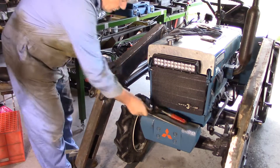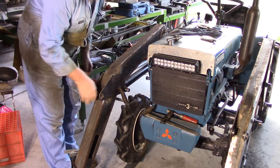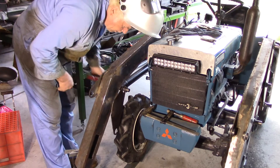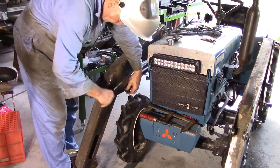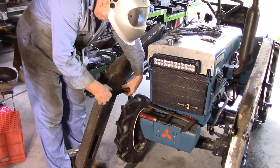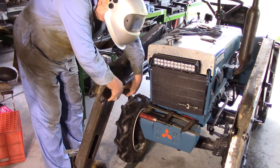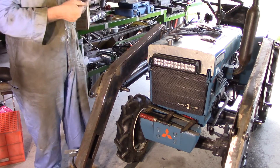It's a little bit wearier on this other side. I think I must have a bit of tack still in under there that needs grinding off. So I'm going to take this other side off. This one's solidly tacked on so I can use him to line it up. I'll take this one off and make sure the tacks I cut before are totally ground down, and then I'll be able to tack this side in as well. I've got a good 4mm gap there — I think it's getting pushed out somewhere by a tack that's still on there from when it was in the wrong spot. Nope, that's just the geometry of it. I took that off for nothing, but while I'm here I will trim these tacks down just the same. Won't do any harm to get rid of them.